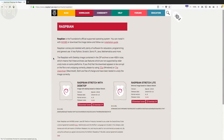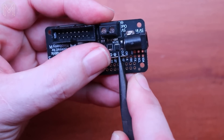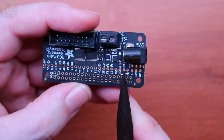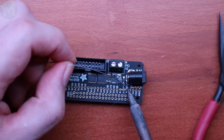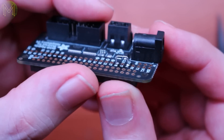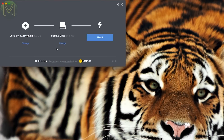Once you have all your bits, download the latest Raspbian image from the Raspberry Pi website. While that is happening, you'll need to make a choice between having a slow panel with audio or a fast panel without audio. The slower panels can be a little flickery sometimes, so if you're happy without any audio, you can make a small change on the matrix hat, which is connecting GPIO 4 to GPIO 18. By now your download should have finished. Fire up the SD burner of your choice and burn that to an SD card.